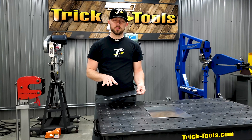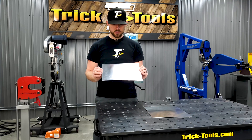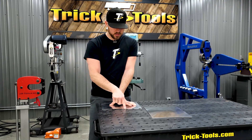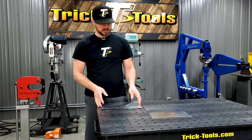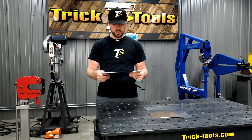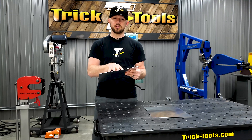When determining what type of oil can you have, take into account how the sheet metal is laying. With this panel, if you try to lay it flat on a table and hold it down, there's looseness on the edge — it doesn't want to lay flat. That means there's too much metal on the edge of the panel, giving it that load and spring.